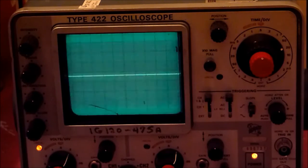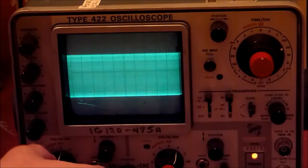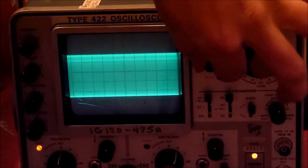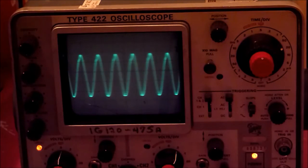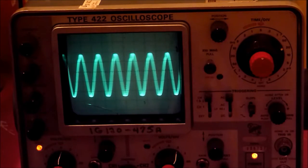Let's see if I get this thing to oscillate here a little bit. No oscillation there — let's go up a division. Okay, now you're starting to see that it's oscillating — these are actually sine waves. Times 10 and there's a nice little sine wave going on for you there. Now I just disconnected from my antenna on top — you're hearing AM broadcast right there, and you can't get it to oscillate by moving the throttle capacitor and tuning. It just overpowers this radio.